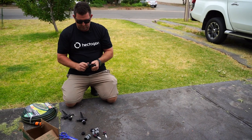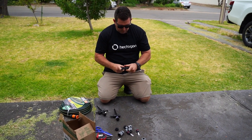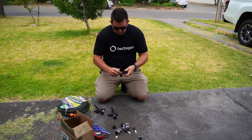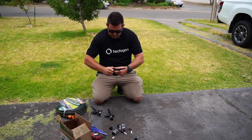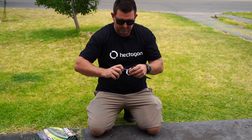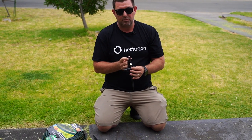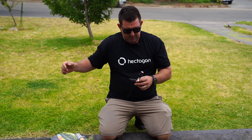We're going to join these all up. All of these fittings have O-rings in them and on them, so you can screw that onto there — you don't need to use thread tape. Screw the sprinkler head onto there, don't need thread tape. Now, that white line is going to become important later on in this process because the white line will be, I think, the right-hand side — but we'll work that out.